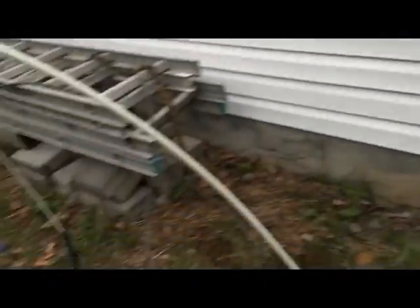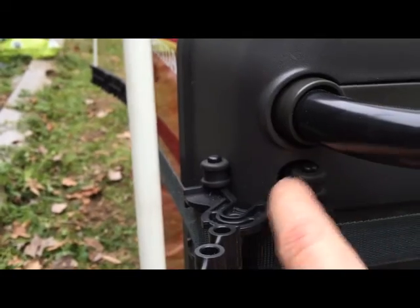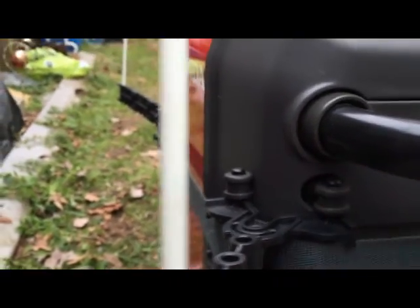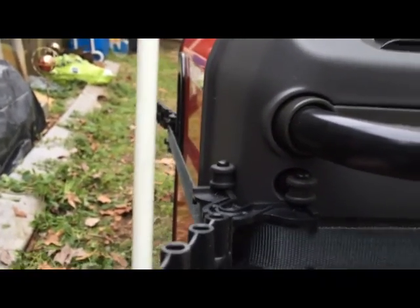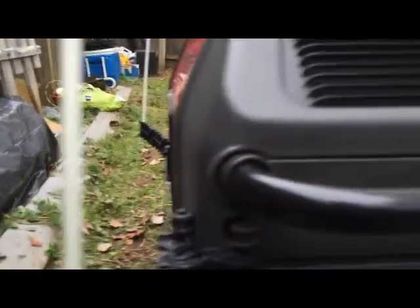On the opposite — the exhaust side of the generator — I've got the other two brackets mounted with the small grommets, and they're positioned so that the upper inner grommet is sitting inside that case indentation for the mounting screw for the case. So there's no guessing. If you mount yours like I have mine, you'll get the same result as I did.